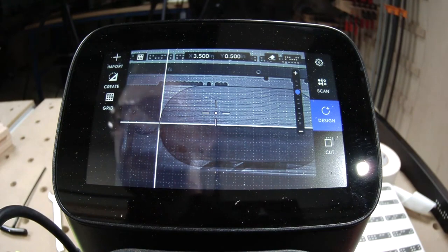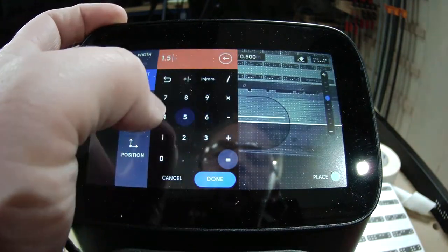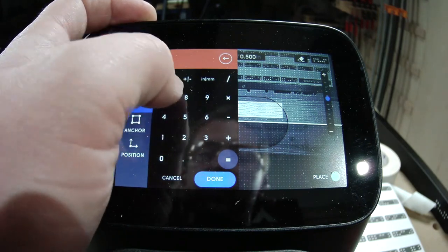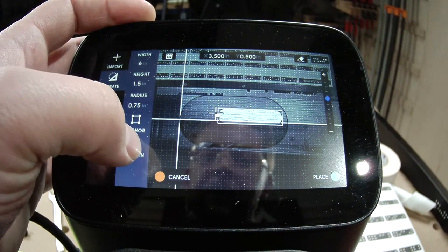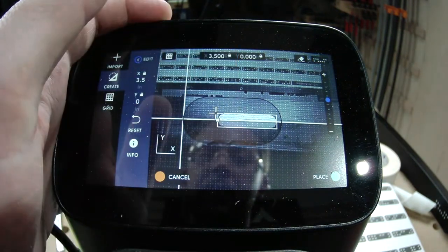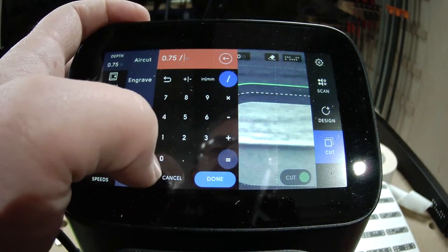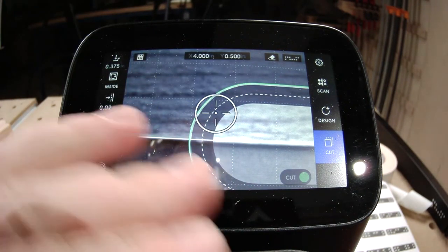All right, for our cutout, we said that was 6 inches by 1.5 inches. 6 by 1.5. And we will give this one a corner radius, let's say, make it a full round, so 0.75 slot. And that is right on the bottom edge at 3.5 inches. Voila. There we go. All right, home stretch. Last thing to cut, and then we can assemble. Again, with that rough offset of 0.02, I'm gonna do my depth cuts and come in with my finished cut after.